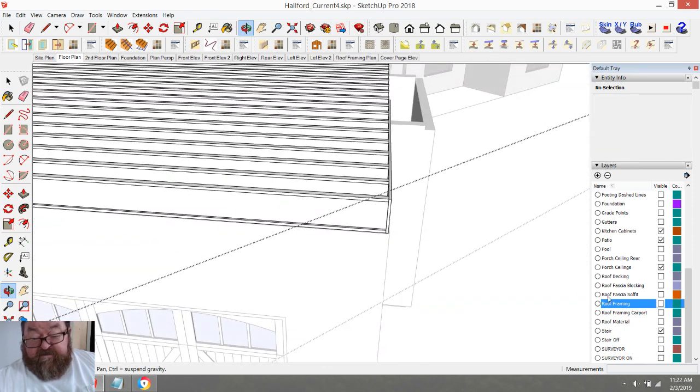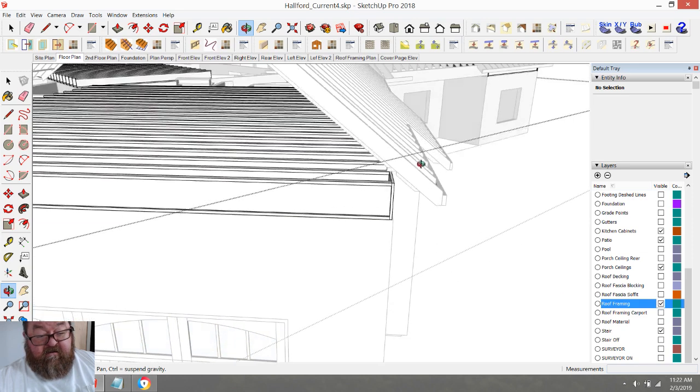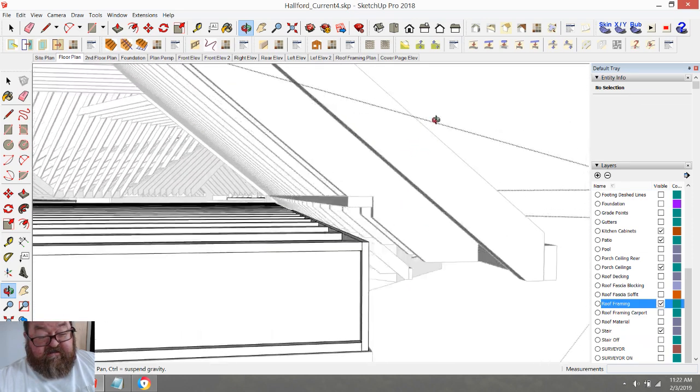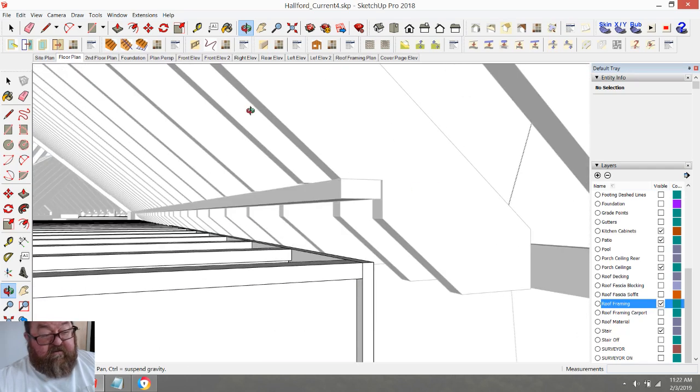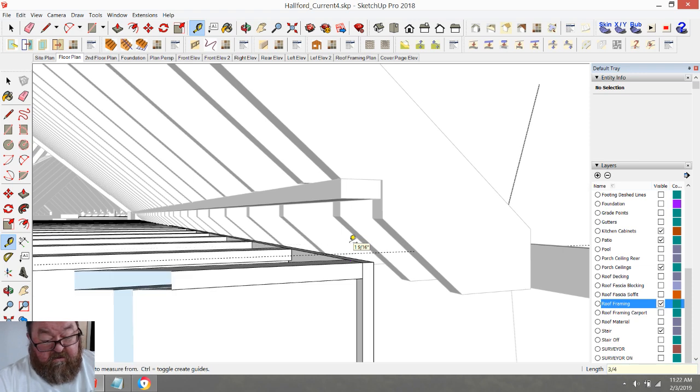Now let's see, the roof is still going to be high, but I don't have to drop it down as much. I'll have to drop this roof down, which is no big deal because I have it as a group. So that's 5. I don't know how it got to be 5 and 16. Well, I know one thing is that I got to come up 3/4 for my subfloor, and then this 2x4 will be sitting down 4 5/16.